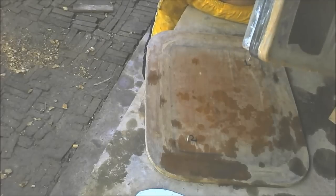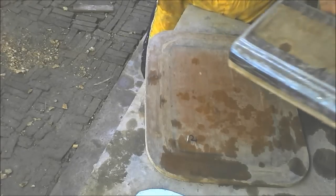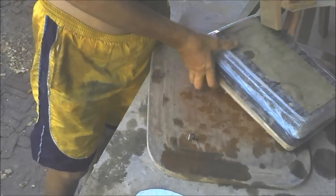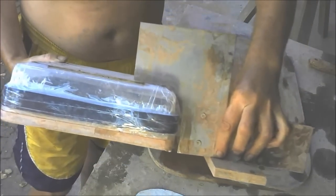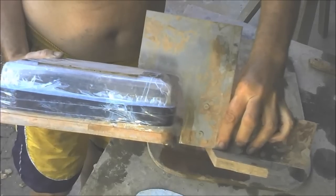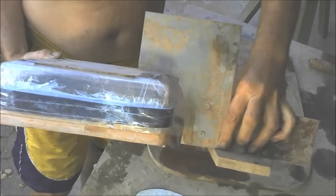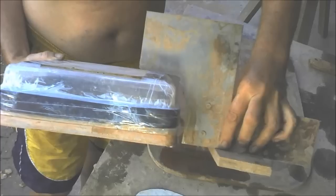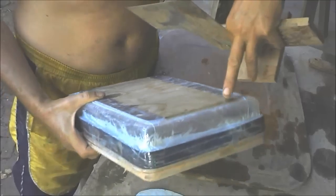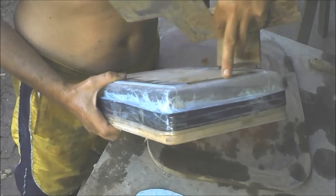The reason I have this black neoprene ring around here is to modify the shape a little bit. This is the cutter I'm going to be using to produce the shape I want. I want to basically try and model that shape as reasonably closely as possible. The wall thickness is going to be about 15mm, about half inch. I'll just use a little bit of neoprene and tape it on. A little bit of plywood here is because there's a plastic rim on the back — it's basically about trying to get a better shape.